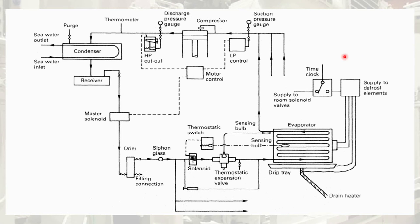Consider if the oil has not been filtered out from the refrigerant: the oil travels all the way to the condenser, where the refrigerant undergoes phase change and loses temperature, causing the oil to harden in the condenser. If the oil is not hardened in the condenser, it travels to the dryer and may pass through to the thermostatic expansion valve. In the thermostatic expansion valve, due to the pressure drop, the oil traces will get frozen or solidified, leading to malfunction of the evaporator or the entire system. Therefore, the oil must be filtered out from the refrigerant after the discharge process.